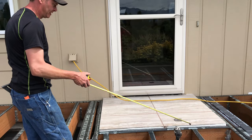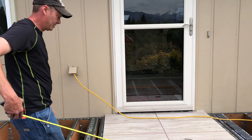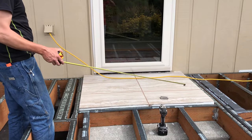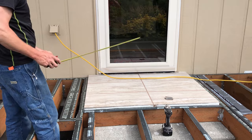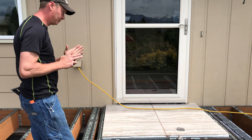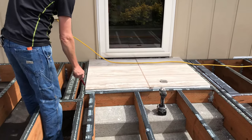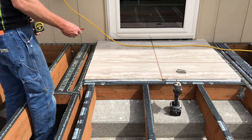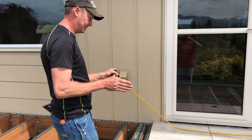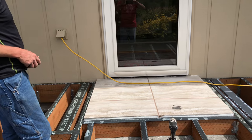I'm going to picture frame this in and I've got about a half inch difference from one side to the other to be parallel, and then about three-eighths of an inch difference the other way. I'm going to compensate by trimming my picture frame so I'll have the cut edge facing the tile edge. I'll be able to adjust it so that the rest of the deck squares out — it'd be difficult to notice.